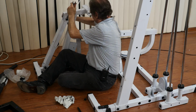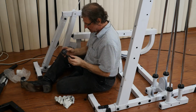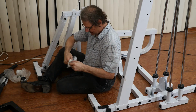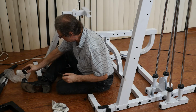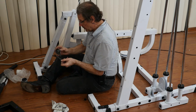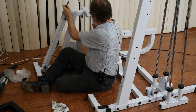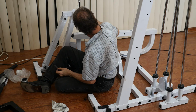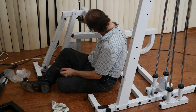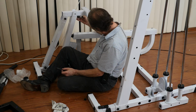There's all kinds of dirt. Oh, see, it just gets nice and tight. So come on, Mr. Bell. I don't like that. See, all kinds of machining, or I don't know what the heck was in there, but I don't like it. But you don't use this on roller bearings because it actually makes the bearing skate a little. Moly is only for plain bearings. Yeah, let's get this guy a little bit. See right through it, coming from the back. Am I still recording? Yep. How about that?